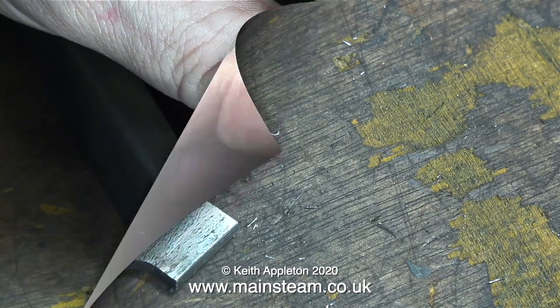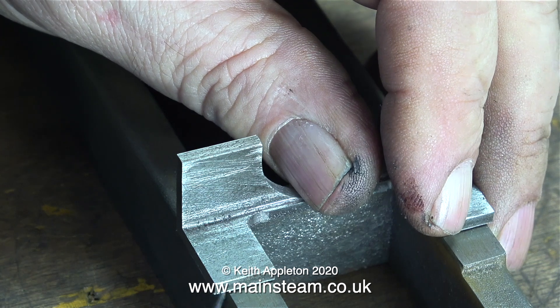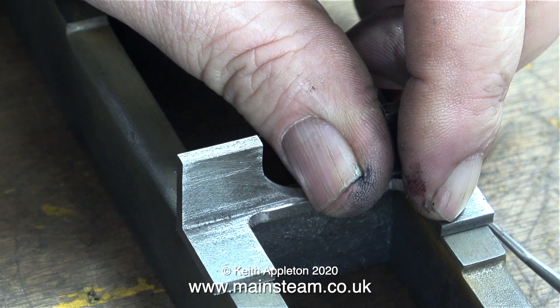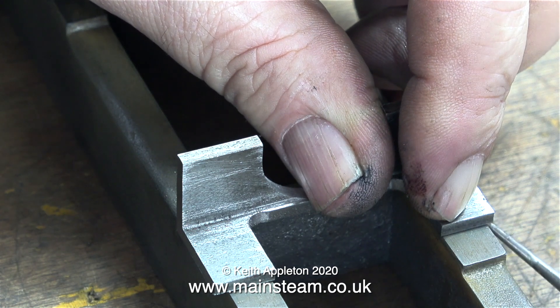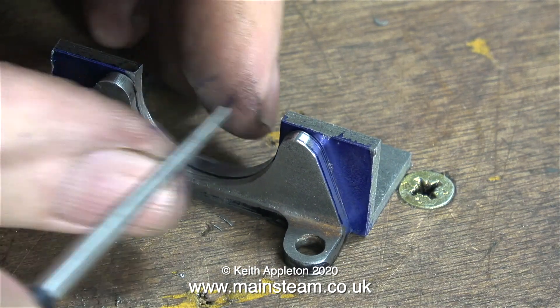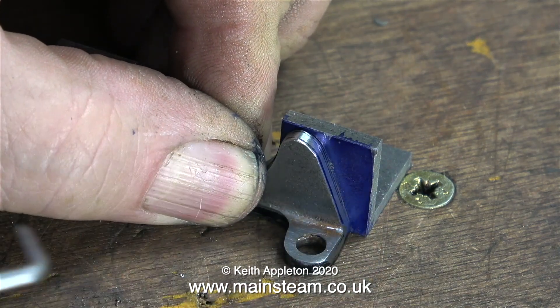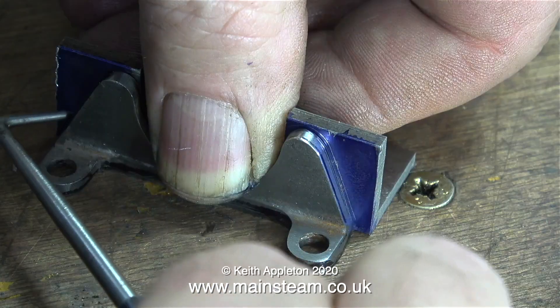Once the job had been finished I removed it from the milling machine and cleaned up the sharp edges using a needle file. In this clip I'm holding the part onto the bed and using a scriber to mark underneath it, so when I start to clean it up on the one-inch belt sander I will know just how far to go. A quick check and comparison with the original bracket from the last episode is quite favorable. Now I need to cut the blank to the same profile as that one.